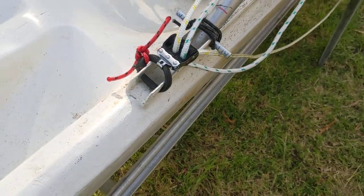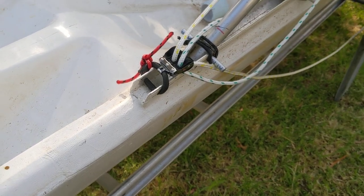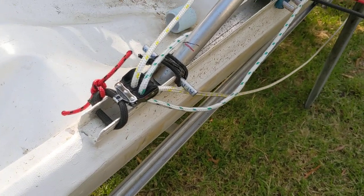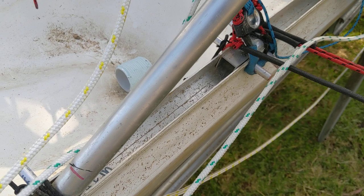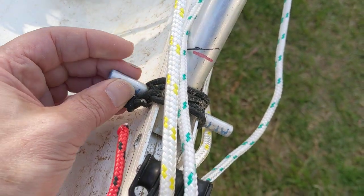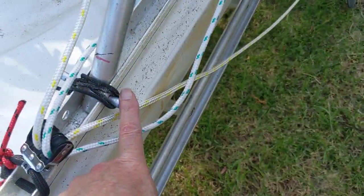So that's kind of the design philosophy of the boat: don't puncture the hull, bond everything on with fiberglass, make sure you spread the stresses out, and see if we can pin everything together rather than bolting things together. The other slight advantage of these pins, by the way, is that because they're a relatively large diameter they spread stress over a relatively large area on these railings.